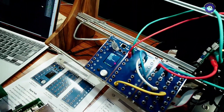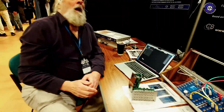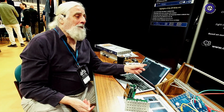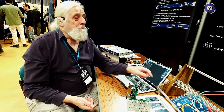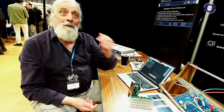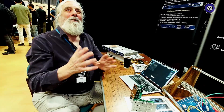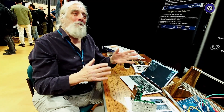So what does Ethernet offer to the equation? Ethernet is RTP MIDI. You can connect this by Ethernet, which means you can use the USB MIDI at the same time. Because if this one's taken over the MIDI, you can't do MIDI merge without problems that could occur. So it's better to switch this one over to network — and it's decoupled as well, so you won't get earthing issues.